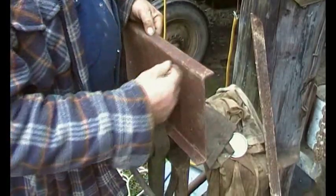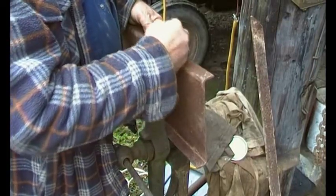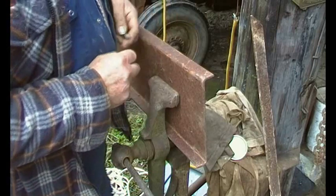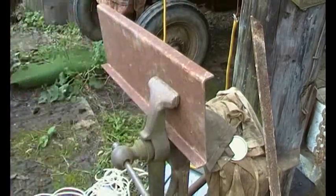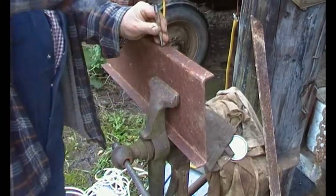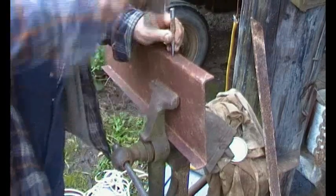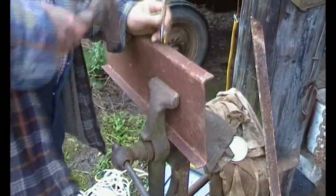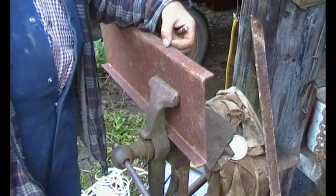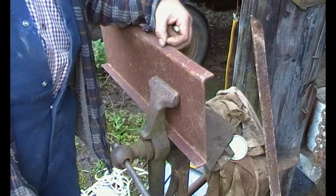So the top of the door is going to be there, and the air inlet will be down here somewhere. So we want the catch to be about there. Okay. As usual, we're making this up as we go along. Right, I'll get a drill, start off with a small drill and work up, and then we can use the 4.5 inch angle grinder with one of those 1mm cutting discs and just cut that out.